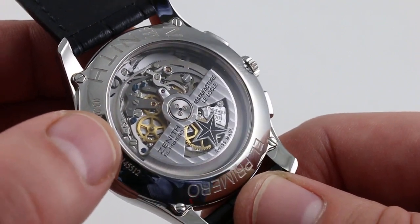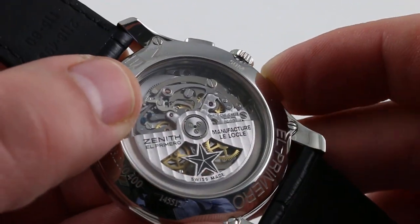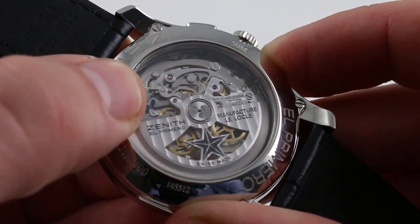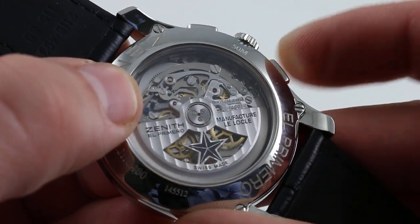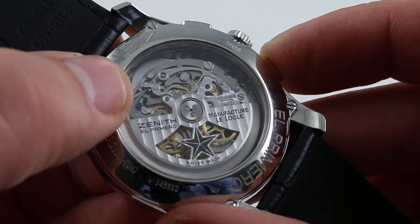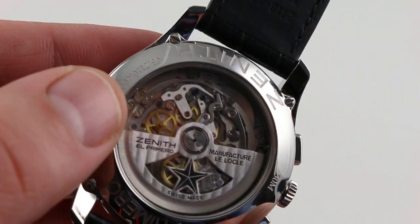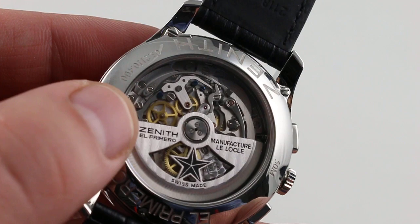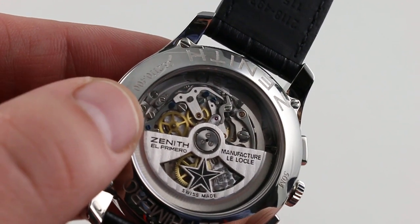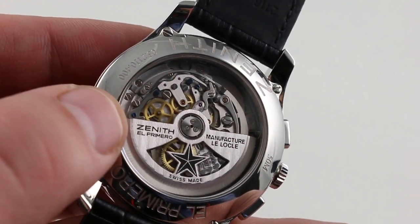With Zenith you feel as though you're gazing into a jungle of machinery. It is a column wheel chronograph — the column wheel is a crisp, traditional system that interacts with levers controlling the actual chronograph mechanism. You can see the levers and the crenellated wheel; it's crisp to operate and satisfying under the finger. When stopped you'll also note a big and beautiful lateral yoke — the traditional horizontal clutch. It's more beautiful than a vertical clutch even if it's slightly less efficient; trust me, it's better to have beauty, especially in the realm of the impractical, which a mechanical watch certainly is.